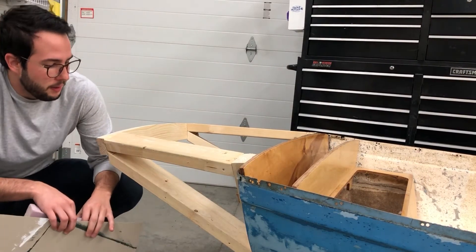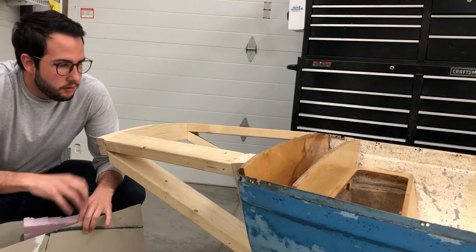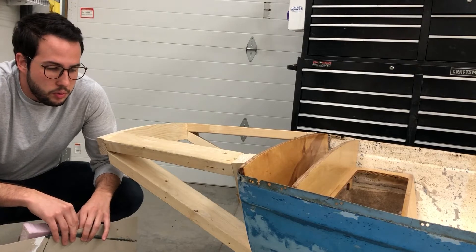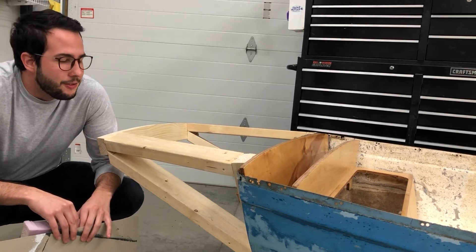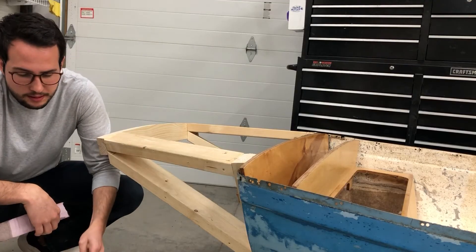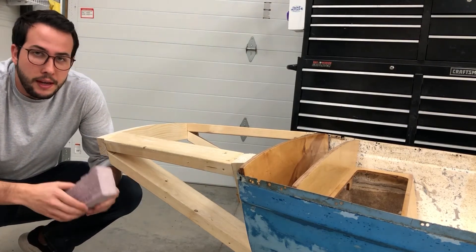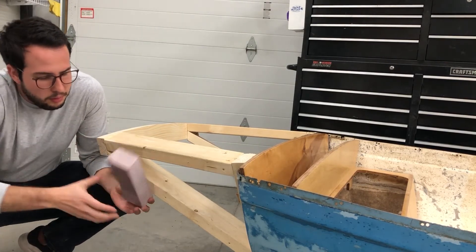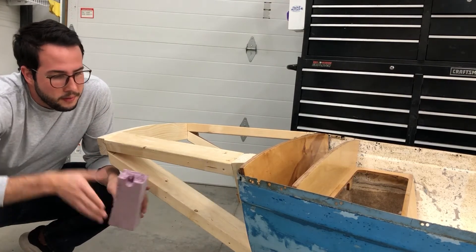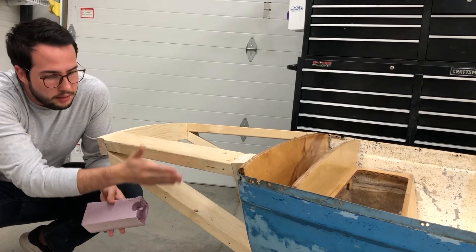Okay, so let's talk about this. This is one of the most complicated parts of the boat. What we want to do, as I talked about previously in the design video, is extend the stern of the boat. Now I'm going to attempt to continue on it. It's just one of those things that's so mentally draining and trying, so it's just difficult to build up the motivation to do it. But today we're going to do it. The intent is this pink insulating foam — you have to paint it with a latex paint or something. You use this and you sculpt the outside of the boat. This stuff sands really easy and you can make pretty complex curves with it. So we took a sheet of this, screwed it on there, and then sculpted and blended it into the side of the boat. Then we could paint it with latex to resist the heat and fiberglass over it with the deck on top.